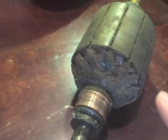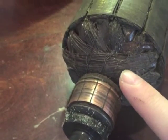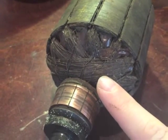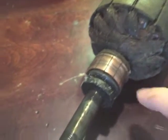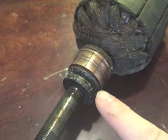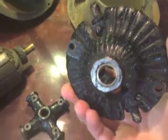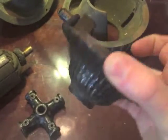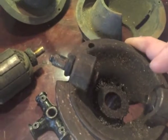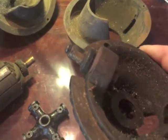Here's the Lundell motor armature — I'm hoping it's in okay condition. You can see all the wires; a lot of them are in fine shape, some are broken, and I'm hoping I can put them back together so the armature will function as designed. You can definitely tell there's been a fair amount of wear — there's a nice big thick ridge on the commutator. Here's something else that's really interesting: this is the lower motor bearing cover and it also holds the brushes. It's a beautiful cast piece with a brass sleeve bearing and carbon brush holders with brass tube pencil brush holders and hard rubber insulators.